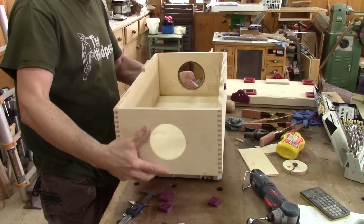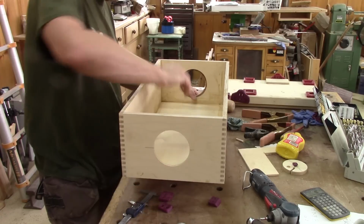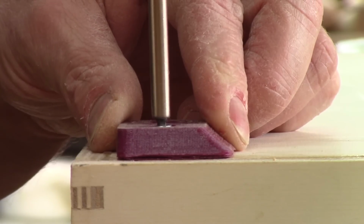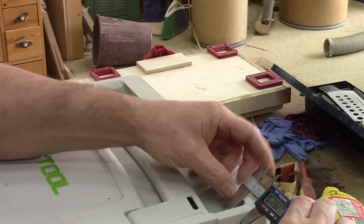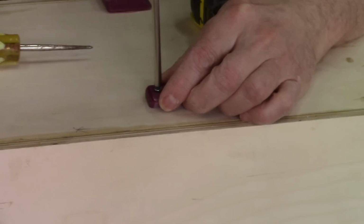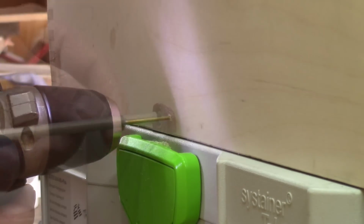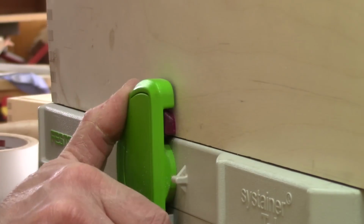To figure out where to screw those clips, I use double stick tape and put the box in place. Now I'm able to mark the location of the screws and I can screw the clips. But for the next 2 clips, I need to take some measurements and transfer them on the box before screwing them in place. I don't forget the bottom hook. And with this, I can lock my box onto one that is the same type of box.